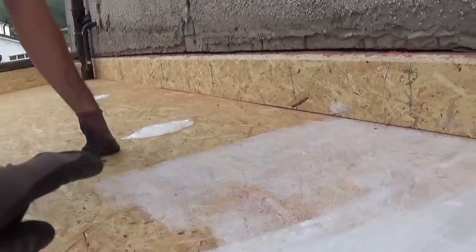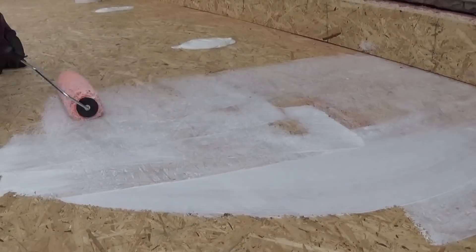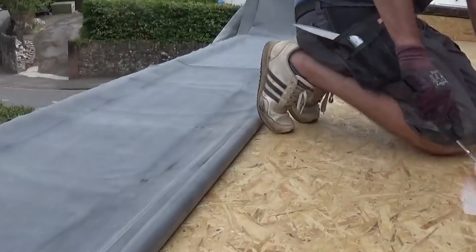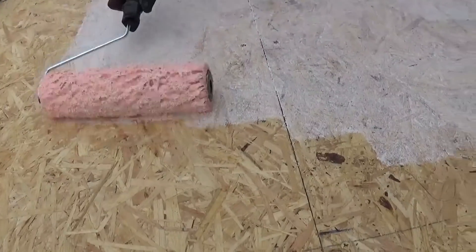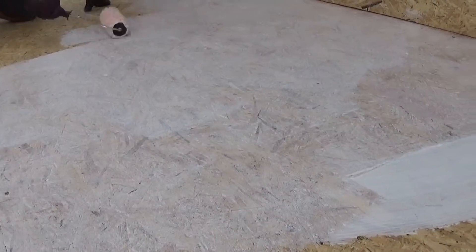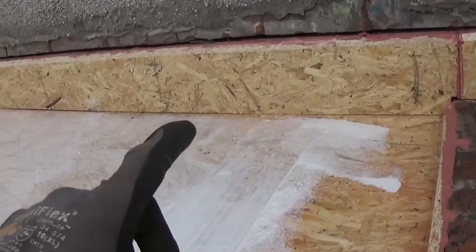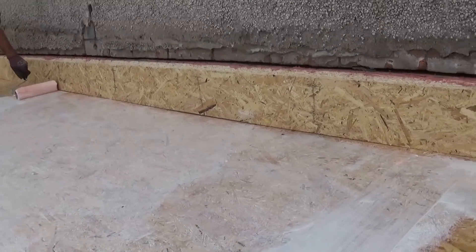All you want to do is pour out your adhesive onto the wood in piles, then get your roller and just roll it on over half of your roof. When you apply the adhesive, do it so it's slightly transparent - you don't want it too thick. Bear in mind if it's a hot day it'll go off quicker than if it's a cold day, but you've got a few minutes to play with it. We'll only apply this decking adhesive to the top of the roof, and then apply the contact adhesive - which is more powerful - to the upstands once the main roof is down.